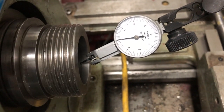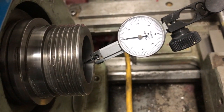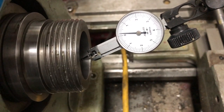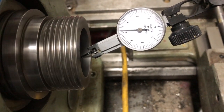What I did is I took the entire headstock apart. I tried honing off all of the high spots and burrs on the spindle by stoning it, and then running a cylinder lap over it to remove those high spots, and then I reassembled it.